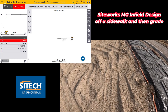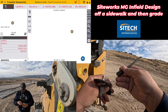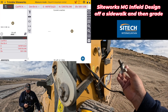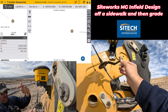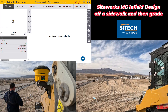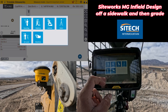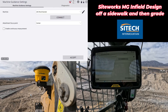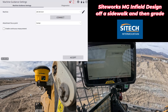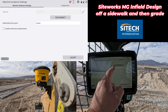I've got a model, I've got a fill — let's get on the machine and start grading. I've been using the external antenna kit so you can leave the antenna on the receiver, but the external antenna kit gets the antenna straight up. Just put it through the bolt with the battery door facing out toward you and the face plate toward the back, make sure it's snug, grab your data collector. We're in the cab now — I'm still in walking mode, so I'm going to hit the mode button, go to machine control mode, and change this back to the 84-inch bucket. There's my 265 CAT skid, 84-inch — and I'm going to connect to the IMU sensor.